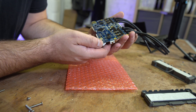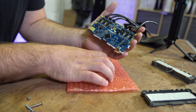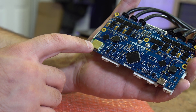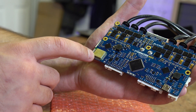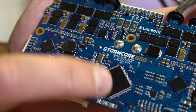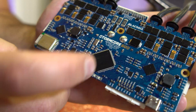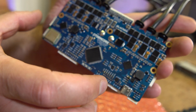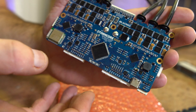Here is the Lacroix Stormcore PCB. This is the Bluetooth module — that's how you talk to the board with your phone or device. There's the antenna for it, and that's the Bluetooth chip. That's the MCU, commonly referred to as the STM, and that's basically the brains of the operation — it's what's telling the VESC what to do, running the program and controlling what's going on.